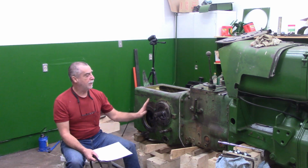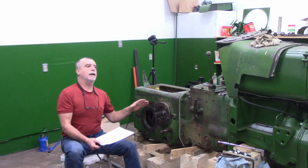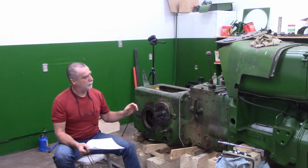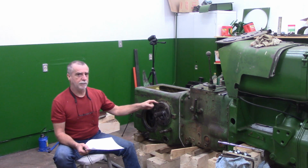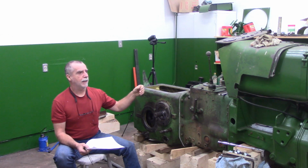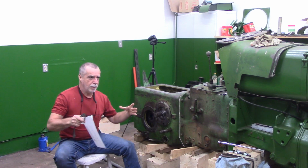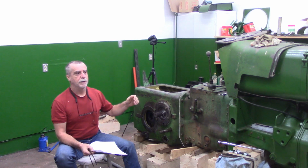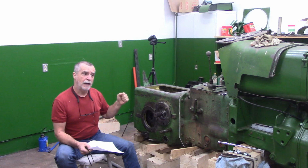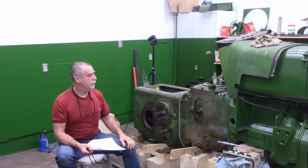Well, alrighty guys, my neighbor and I were fooling with this for probably 20 minutes. Problem was, I had the bearing preload too tight. I think what happened is these aluminum shims that I made, the calipers I was measuring them with maybe weren't as accurate as they could be, and it looks like they're closer to 9 thou than 10 thou. That caused the bearing preload to be too tight. I was trying to move that crown gear to check the backlash, but I had to exert so much force that I was actually moving the transmission, causing some grief.